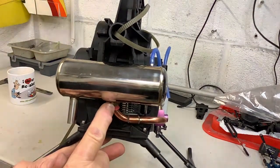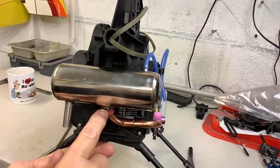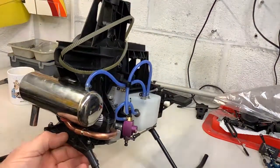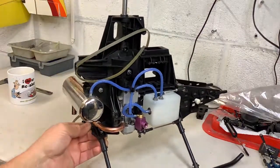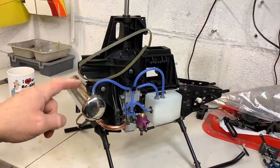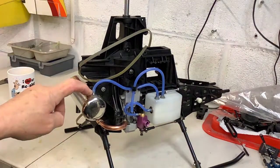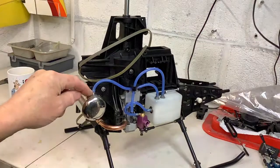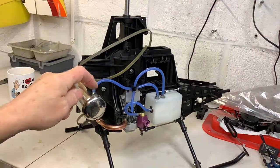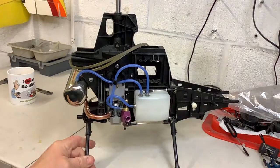When it comes up here, it goes straight, so I could make a different fitting, or we even could put like a little screw through there if I needed to, but we'll see how that goes, because I want to run the engine up before I do much more. I put a pressure nipple in it today, but this is very thin stainless steel, I believe it is anyway, so I might have to brace that in, because I tapped it and I just nipped it up, but I don't think that's going to stay in there, even though it's got thread lock on it. So it was just where I was going to put the pipes, and I wanted to see where they go.